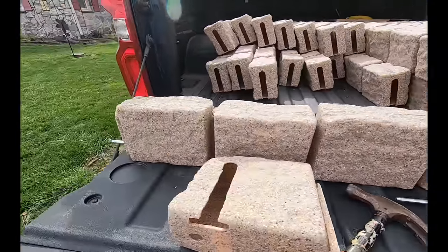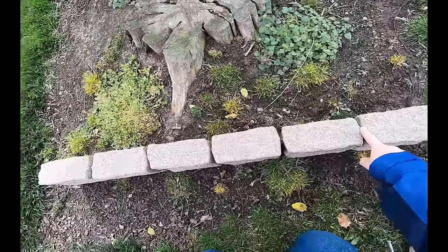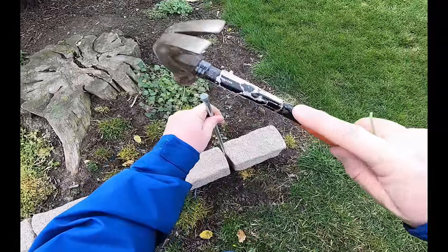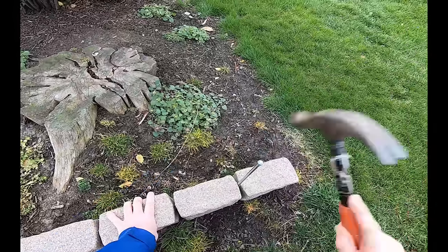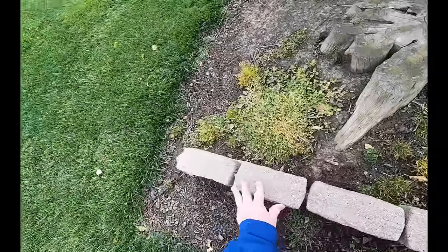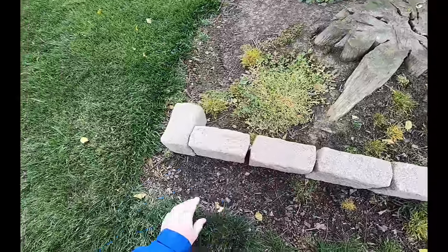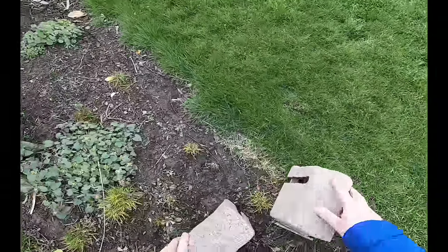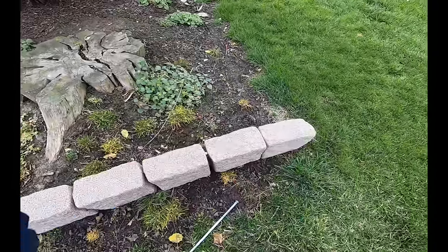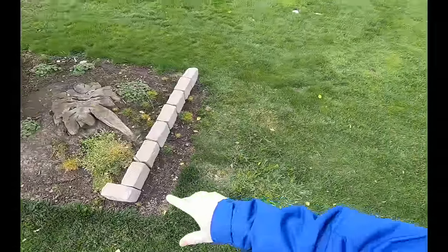Let's go ahead and get one of these in place at the lot line over here and install one, then we'll go from there. I'm going to anchor this one 4-foot piece on one side, then take a couple of measurements from the road so I can get this kind of square to the road. So we're going to drive this spike down, make sure that's square and perpendicular to the ground. I'll put this block in here. I'm not too worried about this front block — once you get the sides on, it's going to solidify this whole thing. We'll measure from the road here just so it's parallel to the road — I got like 16 feet there, so I'm pretty good.